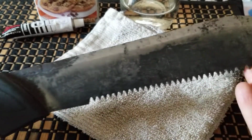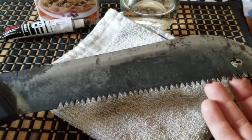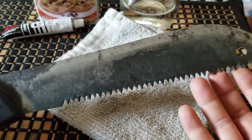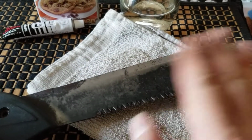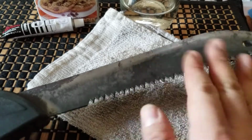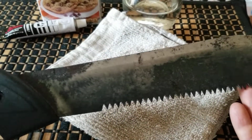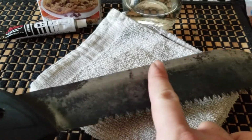I hope you guys enjoyed watching the first 2 videos on it. Basically, the reason why I cut it out was because I was going to be doing the same thing over and over again with the baking soda and the white wine vinegar and my rust eraser. So I did baking soda on here, I rubbed it in, I took the white wine vinegar, put it on, and then just basically rubbed that in and then wiped it down, and it took off a lot of the rust.